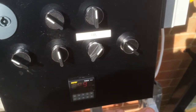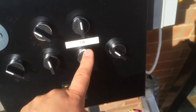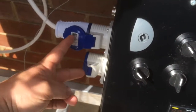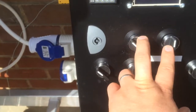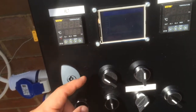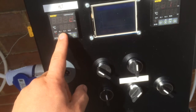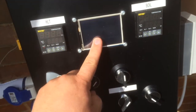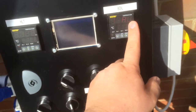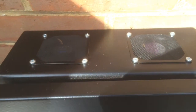I'm going to put some more controls in for the timer. I've got control for a couple of pumps, control for the internal fan, which is linked to the timer. I've got two basic outputs — one for my HLT and one for my boiler — corresponding to these switches here. This switch routes the HLT element output: one position runs from the PID, the other from the oven controller, or the element is off. Same on the boiler side — you can run it off the PID or the controller. On top I've mounted a couple of fans.